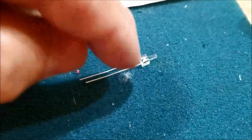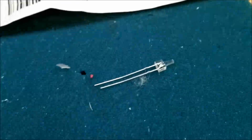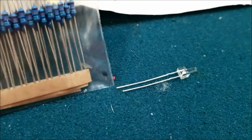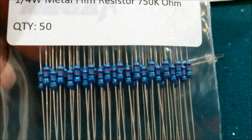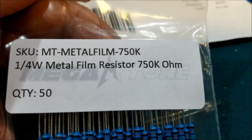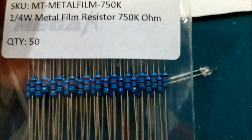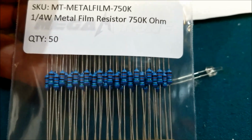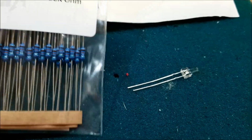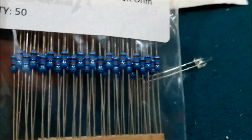Now, if you do this, use this type of light, assuming you're using the Soundtraxx board and the F functions for specialty lights, or the light in the front of the train, the main light, the headlight, you're going to have to put a resistor on it, and that's what was in the picture and the video I watched. This is what it is. So I bought some. Believe me, figuring this all out, like most of us, is not my forte, but I do understand the resistor can go on either side, but you've got to get the positive and negative right. Otherwise the light won't light, but you have to have a resistor in there, or you'll fry that little 2mm LED real quick. So got to have some things.